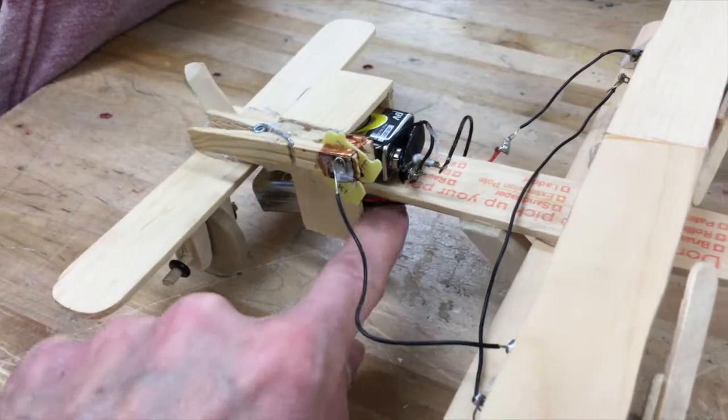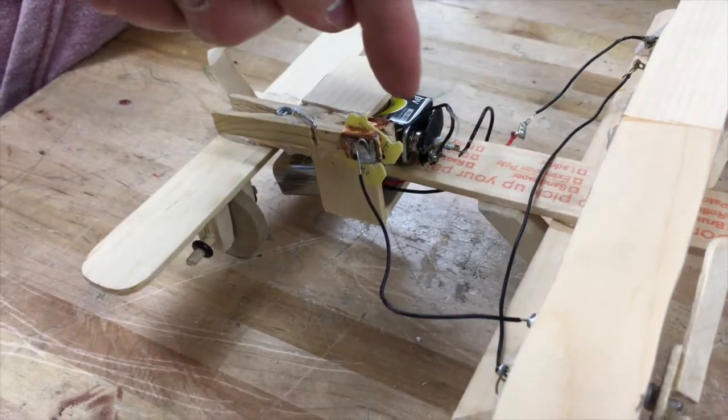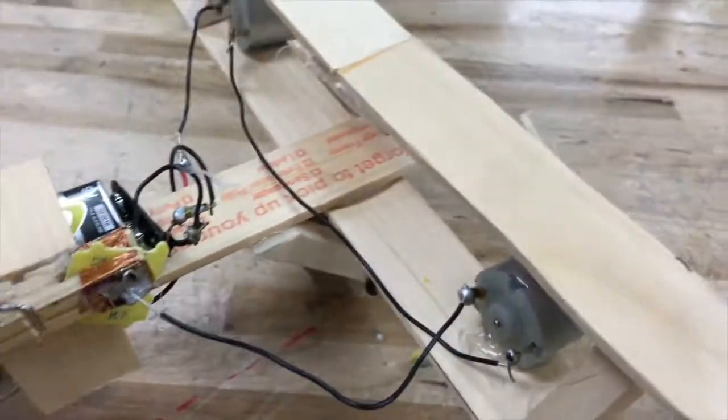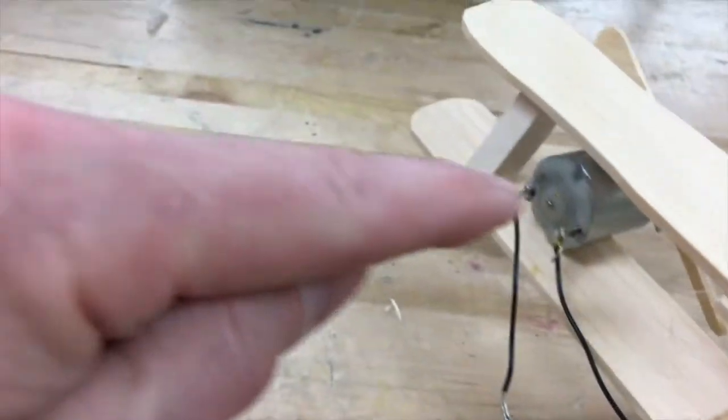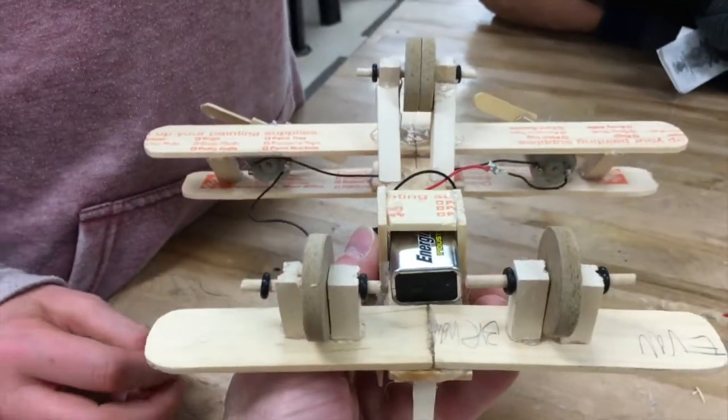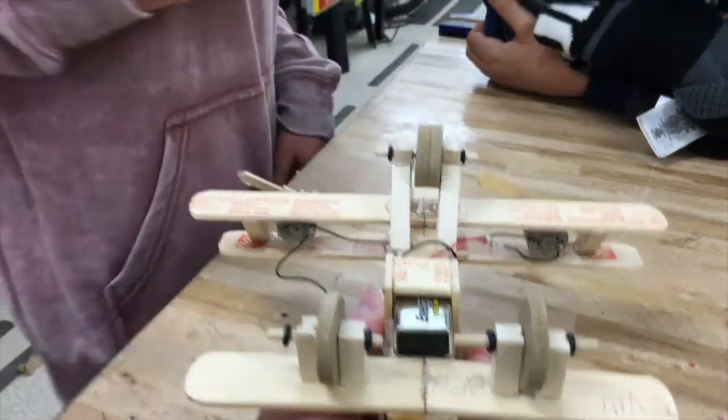The switch is made with a closed panel. The batteries are chained together so the black goes to the red, black goes to the switch, comes from the switch to the motor — you can see that right there — comes out of the motor over to the other motor and back to the original battery right there.